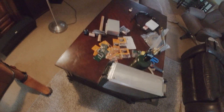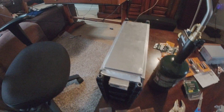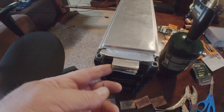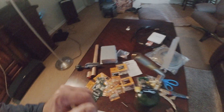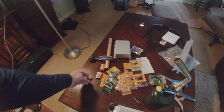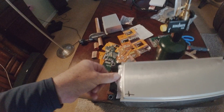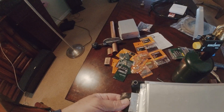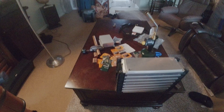That's 7 of them right there. You can see the terminals are right here, and they're cut out of the pack with basically a sawzall or something. This is how I'm making my connectors — I'll show you that in a second. You can see these are cut, taped off, and this is where I'm connecting the cells. This is the positive. So this is 7 cells, and you need 7 of them to make a 24 volt battery, so it's about 350 bucks.